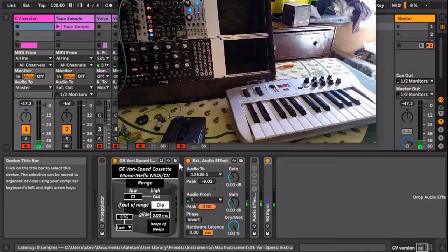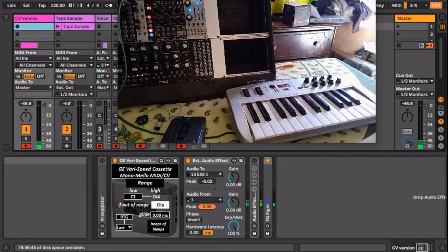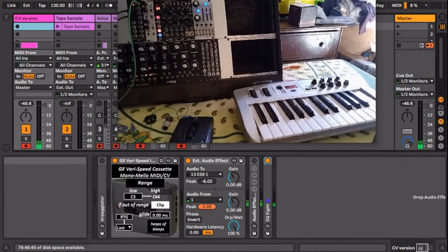I'll leave a link in the description to the videos that go over the two mods that are necessary to make this device work. There are two different versions of this device, a MIDI version and a CV version. I'm just going to go over the CV version because it's more accurate. The CV version converts 14 notes into the appropriate voltages to be sent through a DC coupled interface, such as the ES8 here. You can hardly see it. It's in the top left corner, but yeah, it's going straight into the input of the tape machine right here.